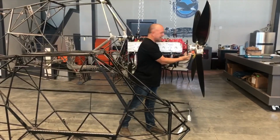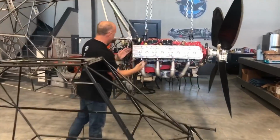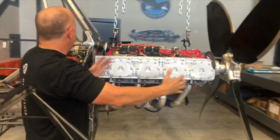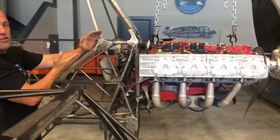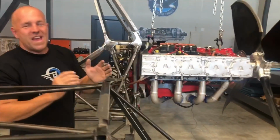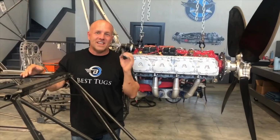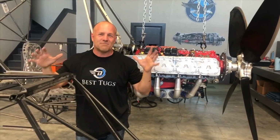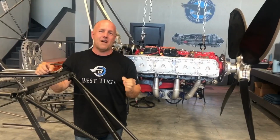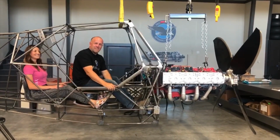The cowling's got to come back to here for everything to work. And then I'm going to make the cowling come and make the seam here, and I won't have the big long boot cowl. Then I'll try and blend that color back further, because this used to be up here, now it's back here. The actual distance of painted area is within just a couple inches. I'm playing tricks with how I'm doing the bodywork, trying to make it look as authentic to a Carbon Cub as possible.